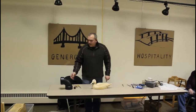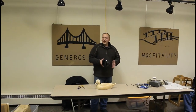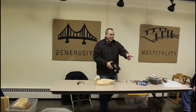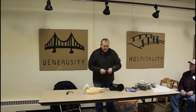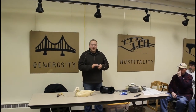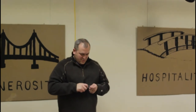I generally use the stuff in between the ends. What I do is run it through the bandsaw — use an older blade because cutting into this is probably not going to be the best for your blade. You cut through there and end up with a sliver kind of similar to what the curve gives you, only curved, and then I draw my tail on there and cut it out. I generally cut them a little wider. You'll end up with saw marks, and sanding would be pretty tough, but you can do it — just take pretty aggressive sandpaper to get them out. Then as you notice it's got some curvature, a knife will carve it.